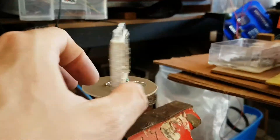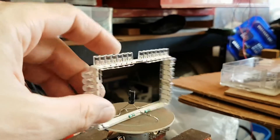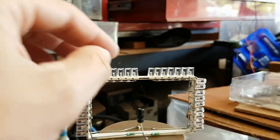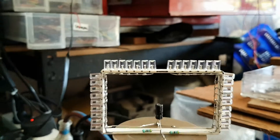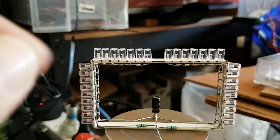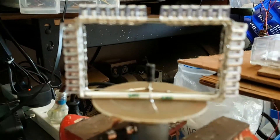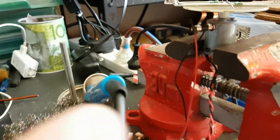Basically here we've got a plastic oblong piece of plastic and it makes a great frame to line up a bunch of LED lights. I've got a whole bunch of LED lights — these are cheapo Christmas lights that I've cut off the wires, stripped them, and pretty much just daisy chained them up together, powering them via 47 ohm resistors to 5 volts DC.